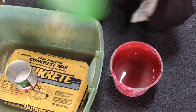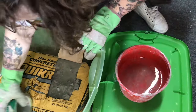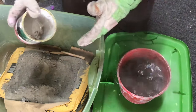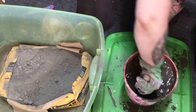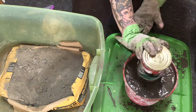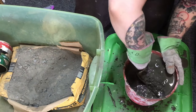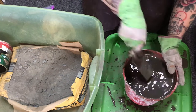Mixing your concrete is pretty easy going. If you were making a structural block or something that needed to hold a lot of weight, you would want to very specifically follow a set of instructions to make sure that the concrete mixture passed the slump test. But in this case, I am looking for a particular finish — I want something a little bit shinier, so I am making it a little bit of a thinner mixture. It's important to mix it thoroughly because the rock element of the concrete settles to the bottom, whereas the sand and the cement sometimes rises to the top. You don't want to end up with a pile of rocks at the bottom and at the top of your casting. I usually keep adding concrete until there's a little mountain that appears at the top. It's very similar to casting plaster if you've ever done that before.